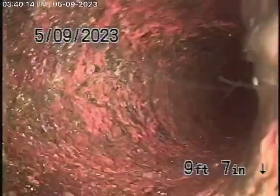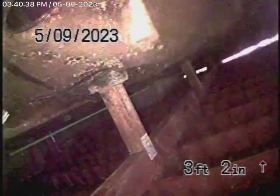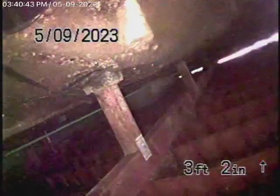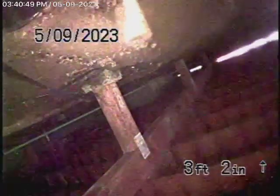You can see how it dives down very deep and then turns. We got the line clear, but the pipe is very old and we're going to recommend it be replaced from underneath the house, because that cast iron is extremely old. We'll reroute it to the outside and tie it into the city sewer where it's more like 7 feet deep. At 13 feet deep it's very deep, but we could put a new saddle on the city and connect it over there.